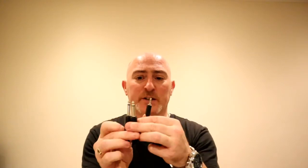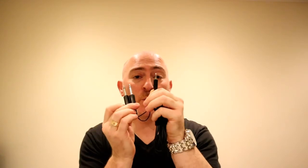Whatever condenser microphone you have, if it works for you, great, just use it. There are a couple of cables you need. You'll need a 6.3mm mono cable to a 3.5mm stereo — there's a black stripe on each one of the big ones and two little black stripes on the small one. The second cable, which is very important, is your XLR cable. You'll need this and it will connect between your microphone and the mixer.